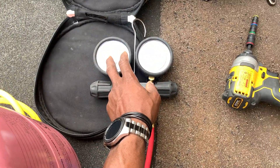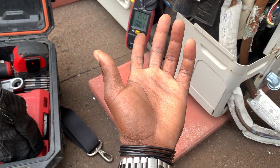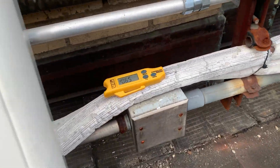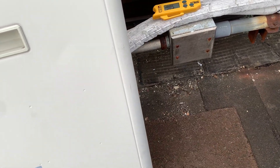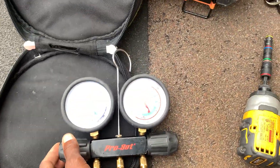The head pressure is up and the back pressure is up, so you think it's all right, but it's not — because the compressor is only doing about half the work. Use your amperage meter, your amp probe, and that will tell you. Coupled with your suction line temperatures as well — this number was at 65 or 64 when I started.